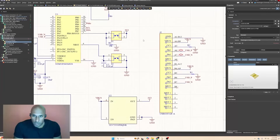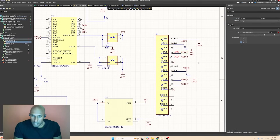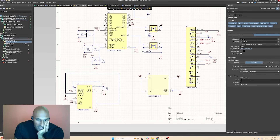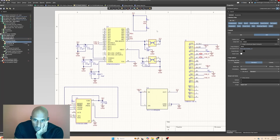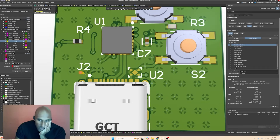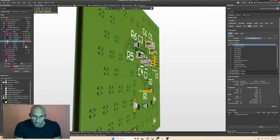Johan presents his board: USB-C connector, using the MCU's native USB capability for programming — no external flash setup. Power pins and USB 2.0 differential pair pins are assigned with hold-down resistors. Decoupling capacitors, a boot mode selector switch, and an LDO are included. An I2C gas sensor was added as an extra feature, with the I2C bus set up for MCU-to-sensor communication and pull-up resistors in place. Four-layer stack-up: layer 1 signal, layer 2 ground, layer 3 power, layer 4 signal. The sensor is mounted on the flip side.